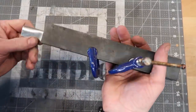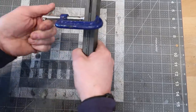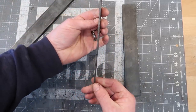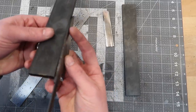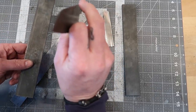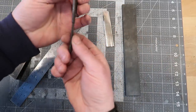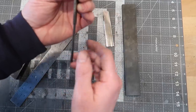We are out of our temper cycle. I did one temper at 375 for about an hour and a half. The reason I did 375 is I want this blade hard - I want it to stay hard. Clearly the clamping didn't really do too much. The good news is I believe that the main portion of this blade is straight. This part here is really not too bad at all, actually. This main portion is really, really nice and straight. It's just right at the tang that we kick off. That could be due to one side having more mass than the other - as it's heating and cooling sometimes it can pull in certain directions.